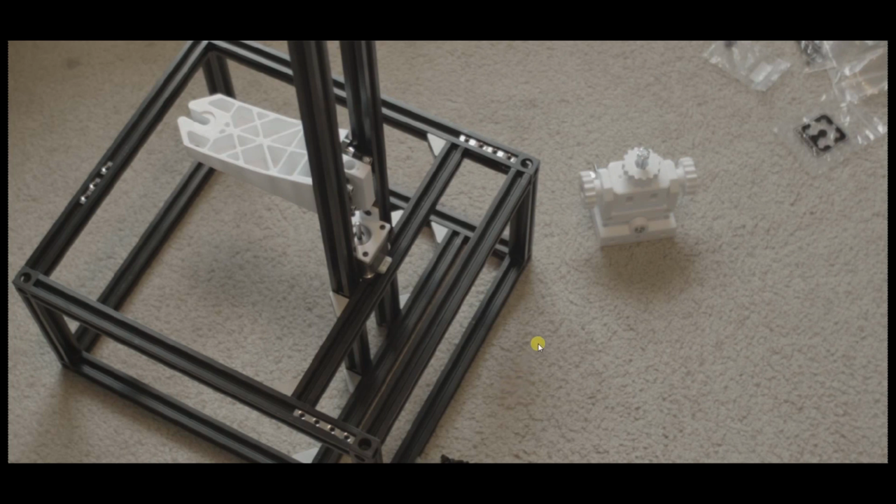And if you can, these rails here, like for example the top rail, bottom front rail, and then these back rails, basically all 6 of these rails here that I'm crossing, I would cut them all together if you can. So if your chop saw has the capacity to cut that diameter or width, go ahead and just tape these all together and cut them all at once. But also you're going to have multiple sticks of aluminum, so you may not be able to do that, but cut as many as you can together because you'll end up with a better match between the lengths.